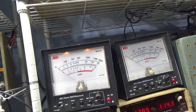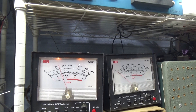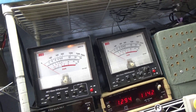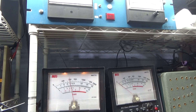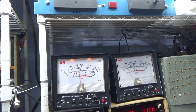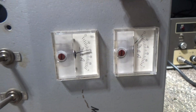Let's go to the high side and the 2000-watt scale. Dead keying just under 200. Whistling to about 250 audio; talking barely moves up. On peak — audio, audio — at least we got some swing on peak. This amp would do better if I took all that stuff out of line and drove it with a better radio, but basically that's what it's supposed to do: a couple hundred average, maybe 350–400 if I took some junk out of line and tuned it up a bit. That's the high side on these two meters; that's the low side on the other meter.